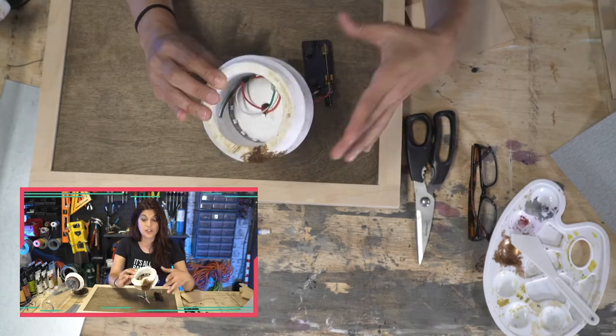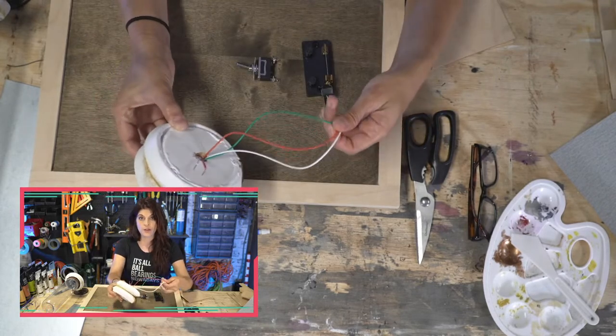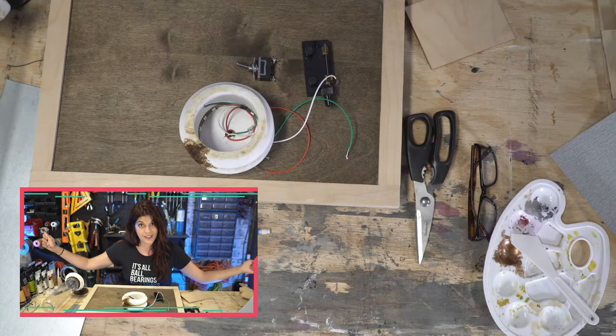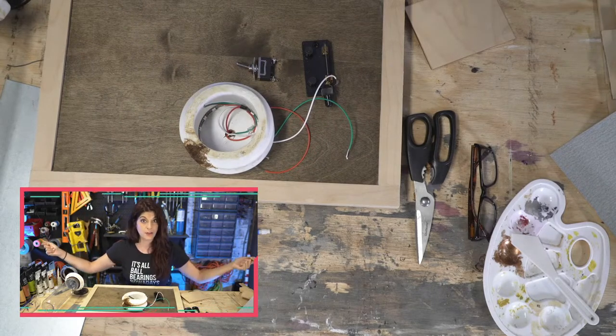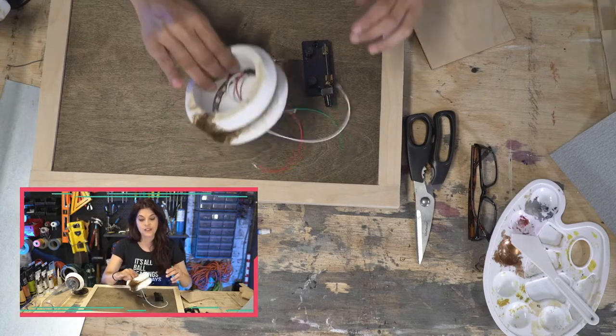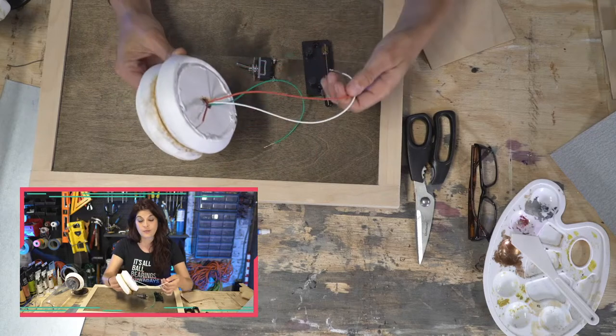That's not huge, but you have to think about the run of the wire. So if you were only powering three LEDs, but you separated each one by a meter, then yeah, it's best to power them from both ends. So it's really the length of the power wire that you have to be worried about.